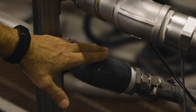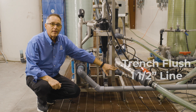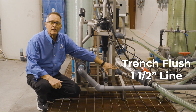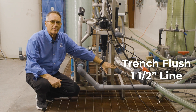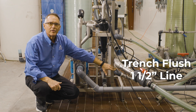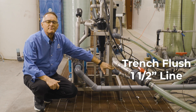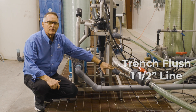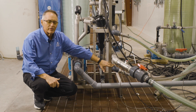The bottom one is going to be your trench flush. The trench flush goes back into your trench for two purposes: it brings water back into the trench to move solids down the trench, and it also brings air and ozone back into the trench for odor and oxygen management and any stored volumes inside the tank. The inch-and-a-half pipe wants to stay inch-and-a-half pipe all the way out to the trench so we're not seeing reductions in flow or back pressure increases back into the system.